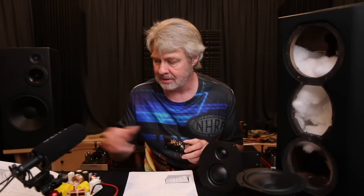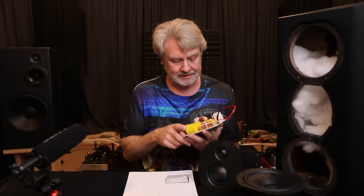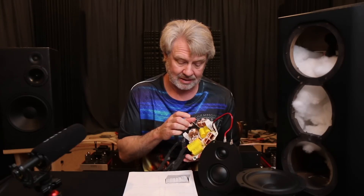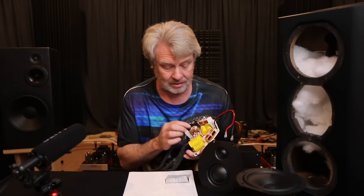The binding posts on the back look nice. Unfortunately, like a lot of other budget products, it's got some steel parts on the back — come on, guys. As for the crossover, there's some good and bad here. They use sandcast resistors, a lot of iron core inductors, and some big electrolytic caps in the circuit. But in the tweeter and mid-range circuits they did use some poly caps, and there was one air core inductor on the tweeter circuit. So it's fair — not all bad but not great. There are no high-end parts here, but it's not horrible.